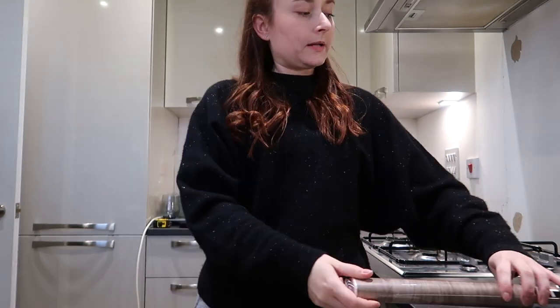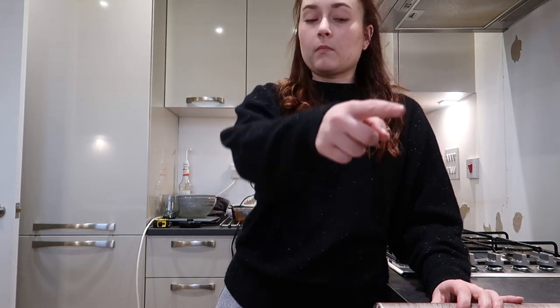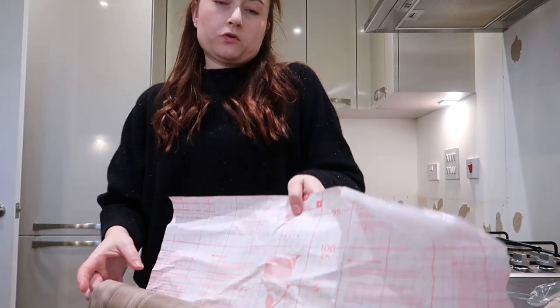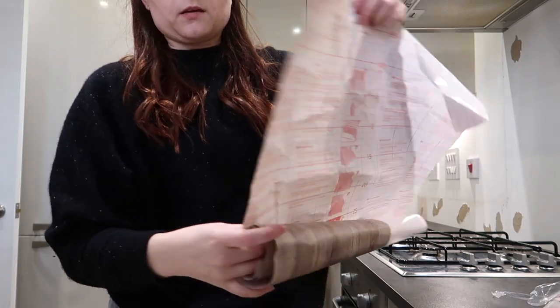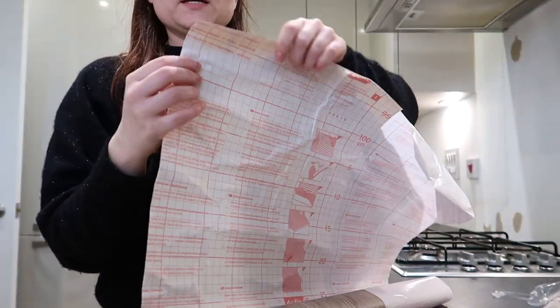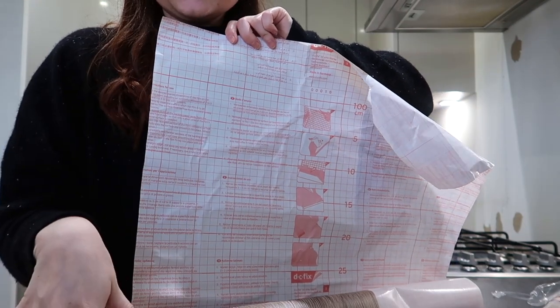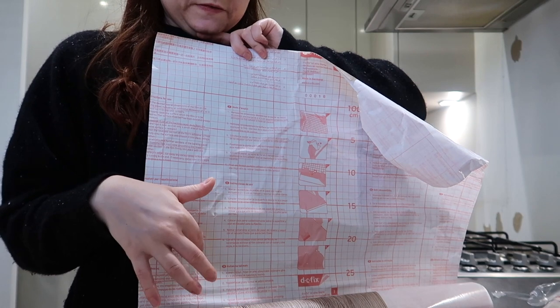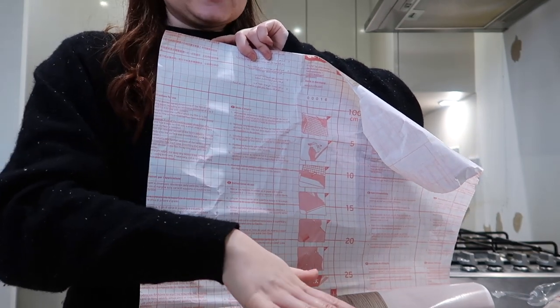So it's going to go up to the back of the wall, but this bit has to be completely clean and straight. I'll have to roll it all out, then on the paper on the back mark it and cut it out so it's exact, and then the excess can come out. On the back of the DC Fix vinyl there is a grid. This is the excess I had to cut out for the sink - I re-stuck it so I can use it again. For this join, I think it makes sense to measure it, cut the line down with a Stanley knife to get the measurement exact, and then lay it down.